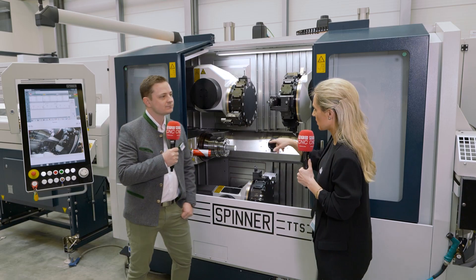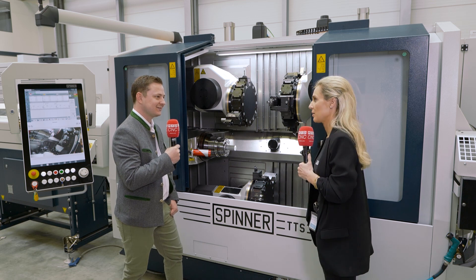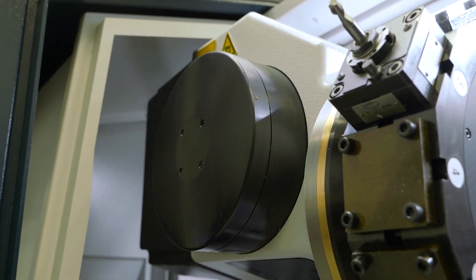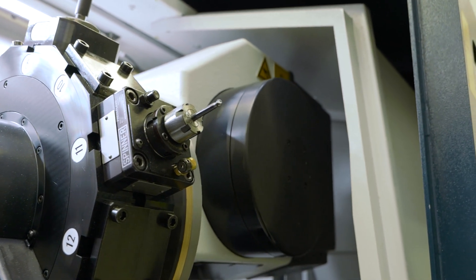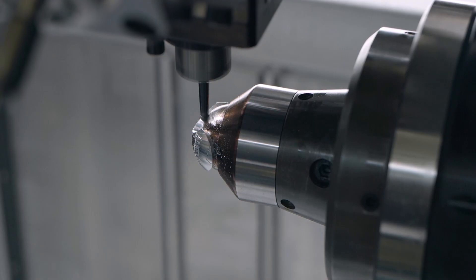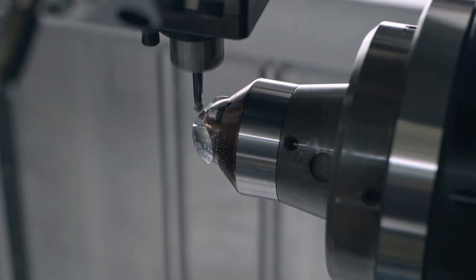This is something quite unusual I've noticed as well. Here you've got these big kind of circles — what are they doing? This is a Spinner special. It's vibration dampers, to erase or minimize the micro vibrations which are coming from the cutting process. A lot is going on in this machine with the three turrets — on the main spindle you could rough cut and on the sub spindle you might want to do a finishing cut. This is producing a lot of micro vibrations, which would give you some influence on the surface finish on the sub spindle. So to erase that, we have those vibration dampers on each of the turrets — to erase the micro vibrations and give you a better surface finish on the part.